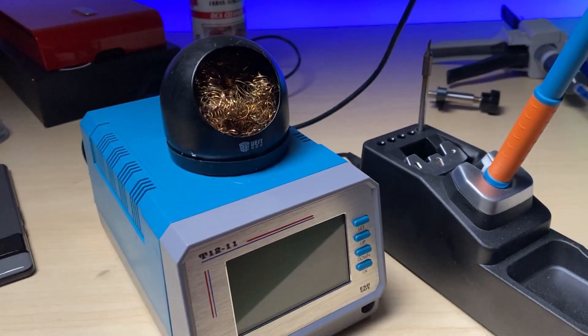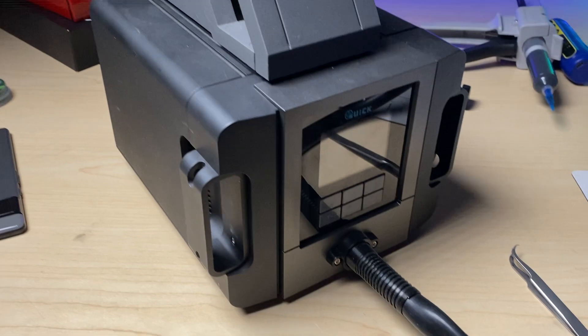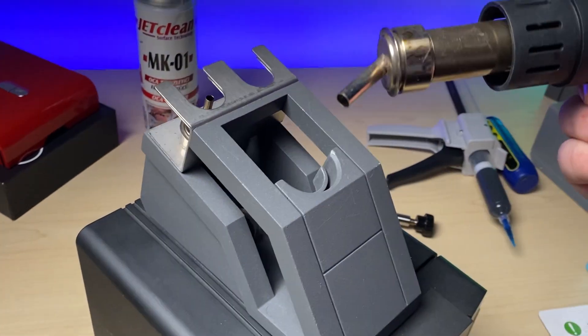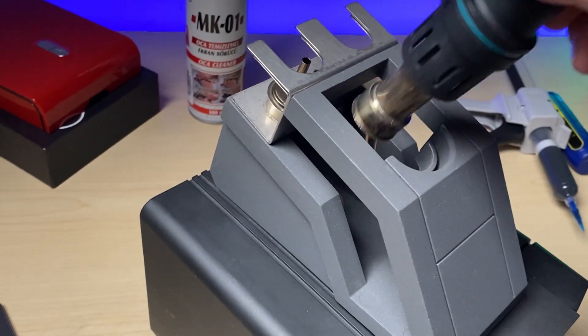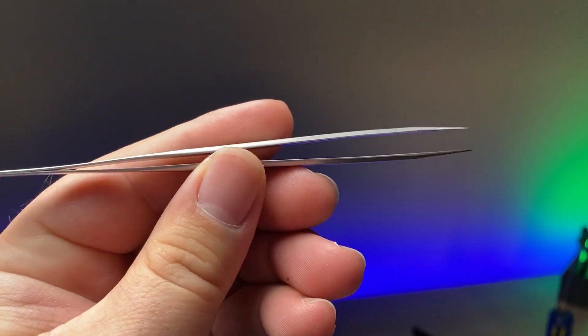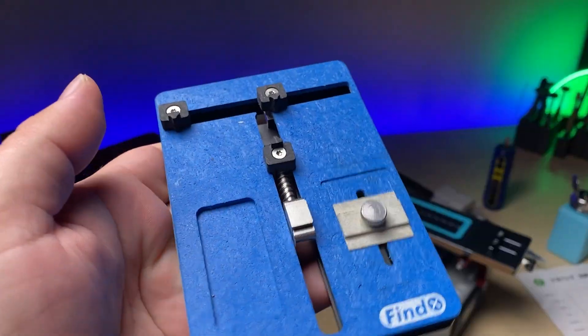The process is fairly straightforward. Having a good soldering iron — I like the curved tips for most applications — and a decent rework station. It doesn't have to be this one in particular, but having a curved tip makes it a lot easier when working under the microscope so that you're not bumping up against the microscope head. A brush of some kind, clean room wipes to clean up the flux without leaving debris, fine tip tweezers, and a clamping fixture makes a world of difference.